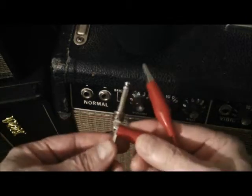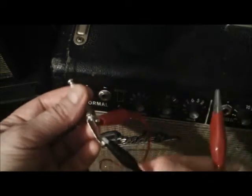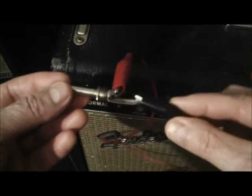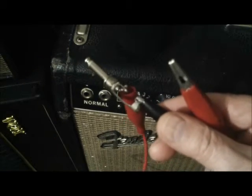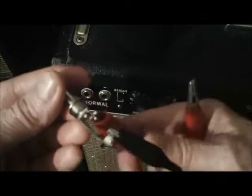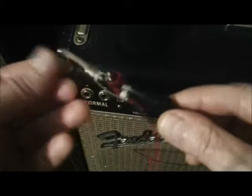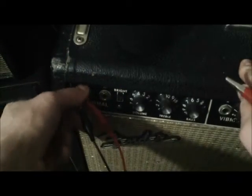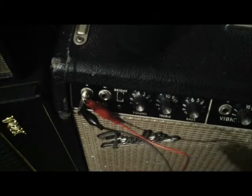Here is the simplest way to find which lead on your tone or coupling capacitor is connected to the outer foil. Starting with a bare quarter-inch plug, I'm going to put a red alligator clip on the tip — the hot — and a black alligator clip on the sleeve ground. We're going to plug that into the amp.